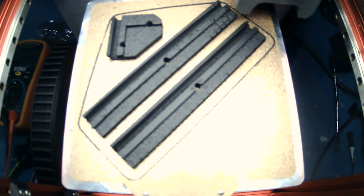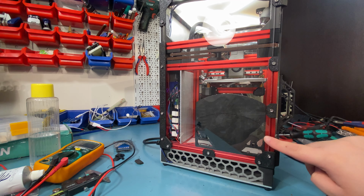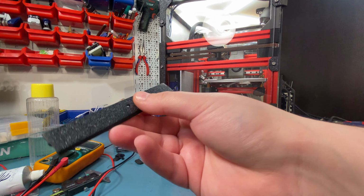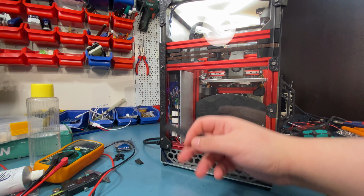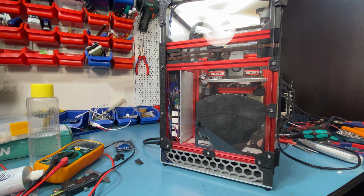And here are the new wire covers printed and mounted, and as you can see, it starts from here, goes all the way to here. So I just replaced these three parts, or the equivalents of these three on this side. And yeah, there are some built-in cable channels in there that route the wires, just like I showed in the CAD. This is the earlier version without the channel that was deep enough, so you can see the idea here anyway. So yeah, cables exit here. You can't see much of any of it really. It routes under here until here, and in this bit, yeah, you can see the wires, because I can't think of a clever way of hiding that there, but at least until there, the cables are routed behind the plastic printed part, so not much of it is visible.